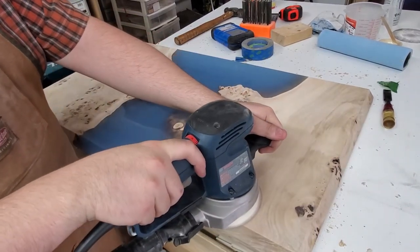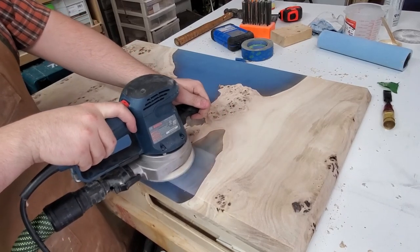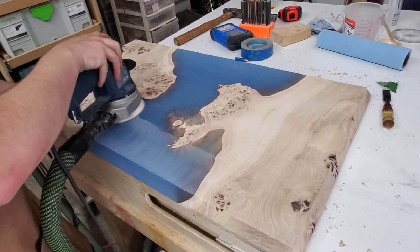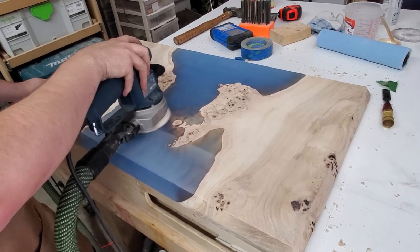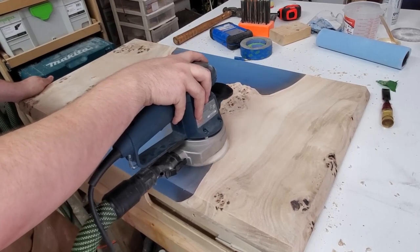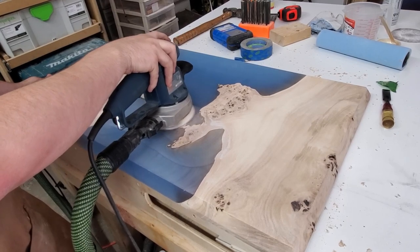After the holes are all drilled and the inserts are put in, I start finish sanding at 240 grit and move up to 320. I stop water popping after 240 and just wipe it down with a damp cloth — not looking to water pop, just wiping off the dirt. I'm not very good at sanding so I'm not going to give you any techniques on how to sand.